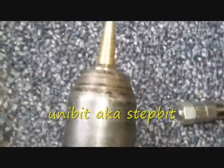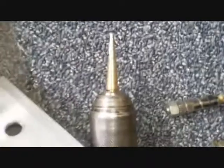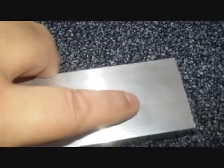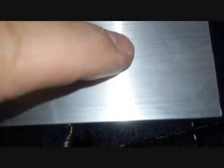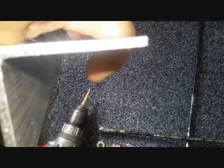For all the drilling I'm using a unibit — a step bit that basically starts off small and goes up one diameter at a time. I have a three-pack of different diameters; these are the easiest way to keep a nice straight hole when fabricating. I have these holes marked and I'm going to drill them out. Up here I'm going to measure so it's directly between the U-bolt — it'll be a 5/16 inch hole so you can put this on top of a quarter by 20 tripod mount or a light stand mount.